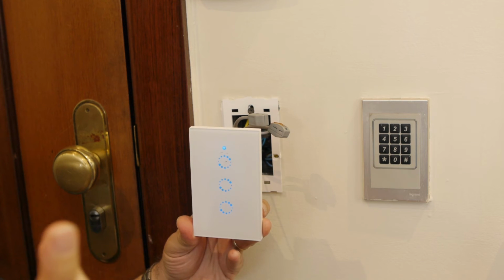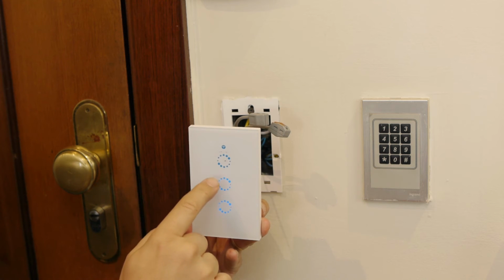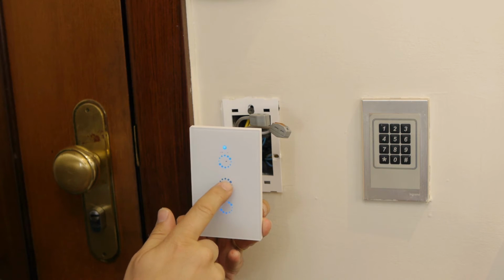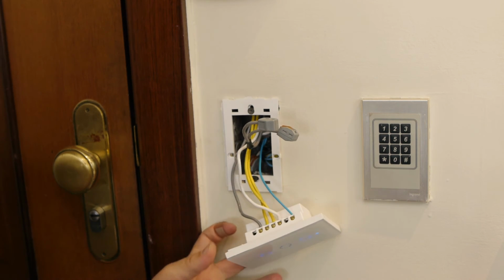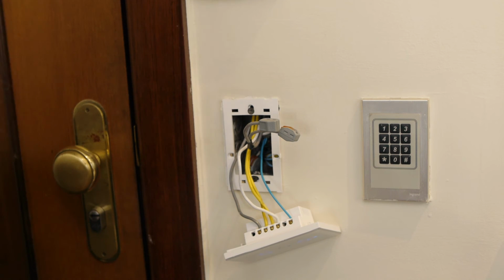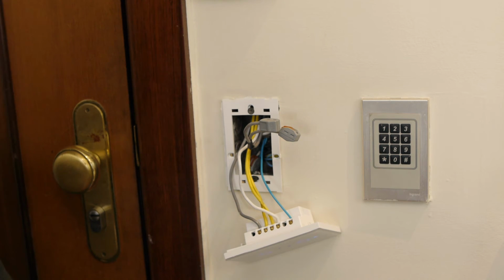But then suddenly there's this doorbell ringing in the background. And it is not that it would be this connector. So if I switch this one on, then it's still off. But if I have the 3rd one, then the doorbell rings. So we basically cut into the doorbell. So we don't have any ground here. And yeah, back to the drawing board.